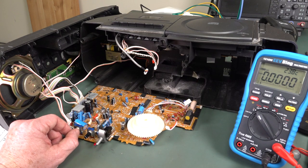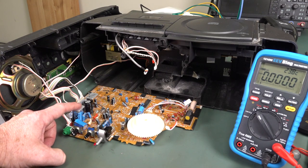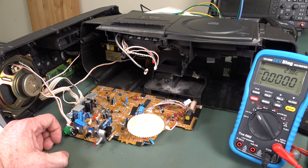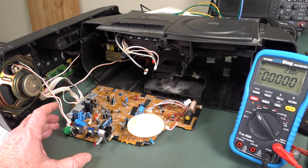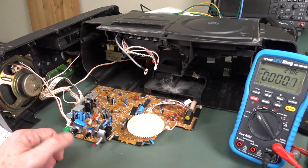Every time you use them, they thermally cycle — they heat up and not all heat gets out of the heatsink. The pins heat up and cool down. You do that for 20 years and the thing can fail. It depends on the exact type of alloy solder used at the time. Different batches can cause problems, and there's all sorts of metallurgical stuff that goes into that as well. So that was a pretty easy fix in the end. I'm going to put this sucker back together — pretty sure it'll be winner winner chicken dinner. All I've got to do is find a CD to try it, or maybe a cassette.